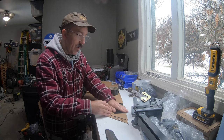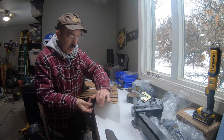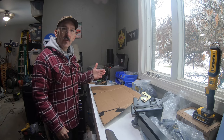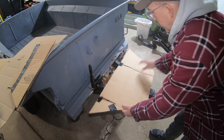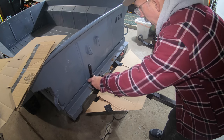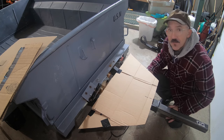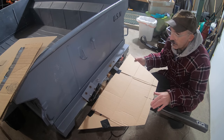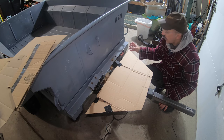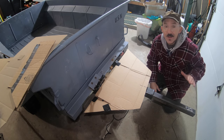It seems like I always get some type of bug in the winter. All right, I think this cardboard template will do it — that'll give me a footprint to put on the trailer and figure out the tongue length. This one is 34 by 16 by 15. Looking at it on the trailer, I think that would fit right about there. Overall I think I like that size — at first I thought 30 inches would be plenty, but then I started looking at a larger battery and it's going to fill up fast. Plus add a few other components and I think the 34 will fit the lines of the trailer well, and I'll have enough room in the corner for my rack post.